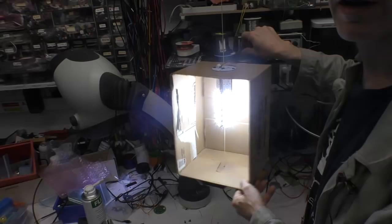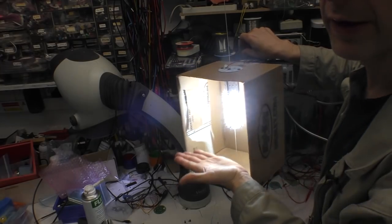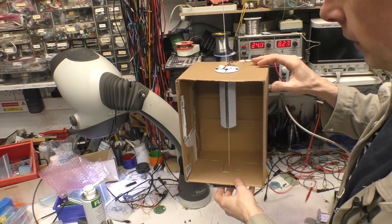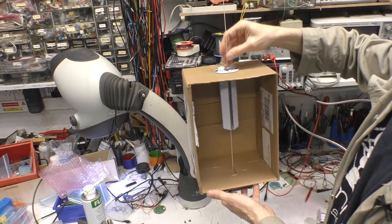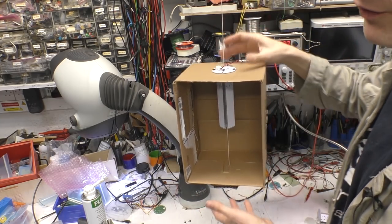So we've got the LED assembly in the centre. Say that they were cubes, so the bottom edge would be about here, and we spent quite a lot of time experimenting with different LED layouts just to get nice uniform illumination on all 5 sides. These were hung on steel suspension wires. They had, I think, about 2 or 3 cubes per drop, but only one of the cubes in each drop actually had LEDs in it. The rest were just dummies.